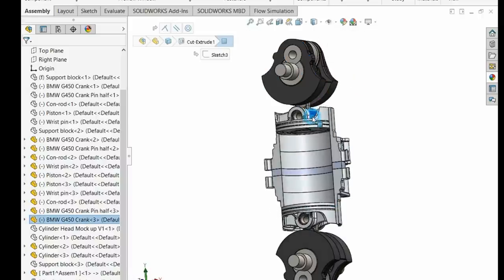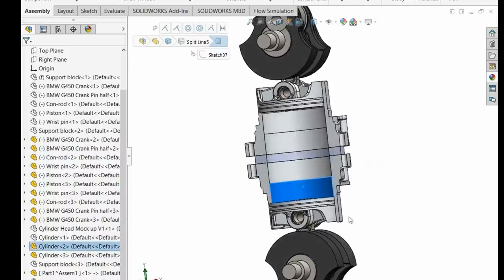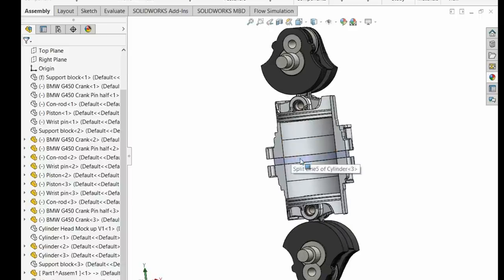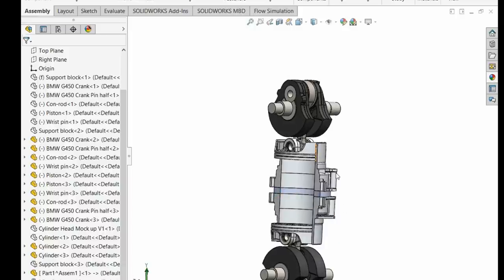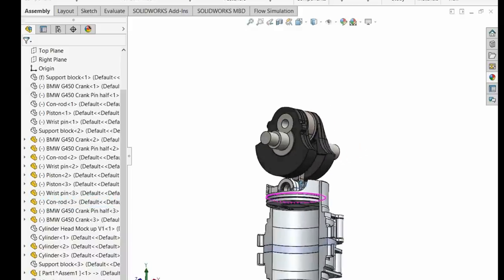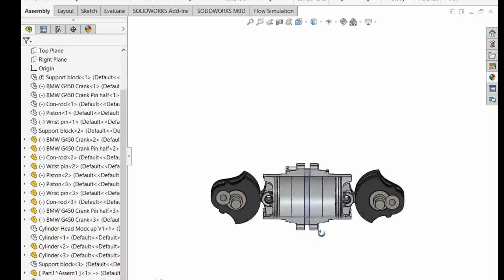We already make cranks, we already make rods, we already make pistons, we already make cylinders, we need some injectors, we need some sleeves with some ports in, and you would go out of your way to get the best DLCs or whatever anti-friction coatings on your gudgeon pins and your bearings and just everything. You'd go to that extent. With a system like this, because it's not a proper pumping two-stroke, although you could use it as a pumping two-stroke, or you could run a little supercharger off it, or anything like that. We're not talking high pressures or anything. You could run needle roller bearings in here, or angular contact bearings, whatever you want, so you don't have to have an oil pump system. You just use splash or something.